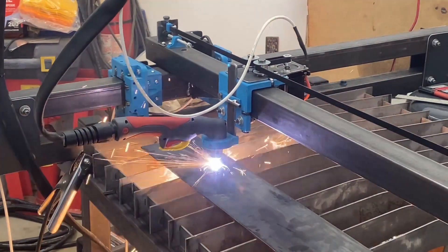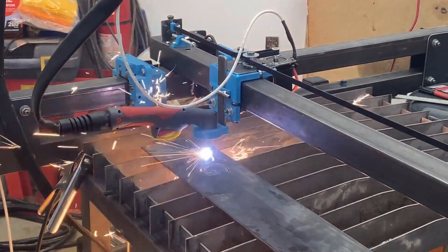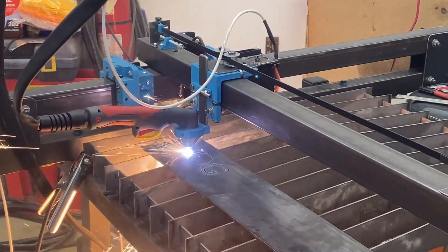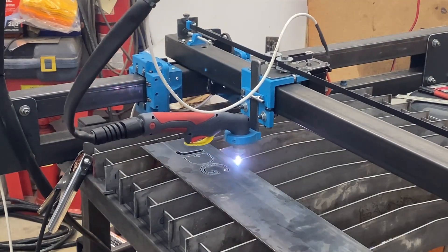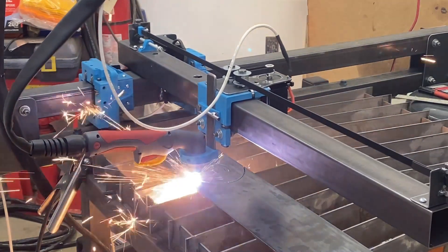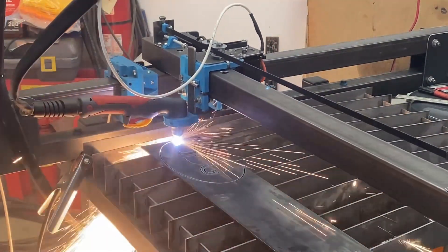The piece of steel I was using is a little bit too small, so it kind of missed part of the cut at the top there. But yeah, this was just a trial run anyhow, and I learned I didn't have the water tray on at this time because the machine wasn't painted and I didn't want to get things rusty. I found that it is fairly messy when you don't have the water pan on — you get a lot of dust and debris and lots of sparks flying over in the garage. It's a lot nicer when you have the water pan on, but like I say this was just a first try and it was pretty successful.